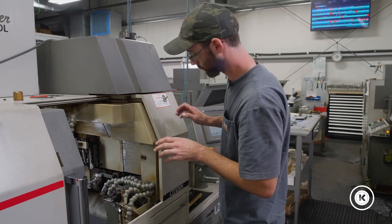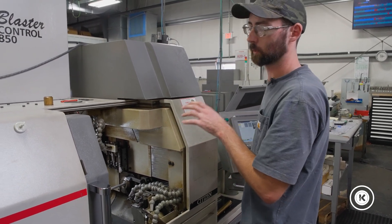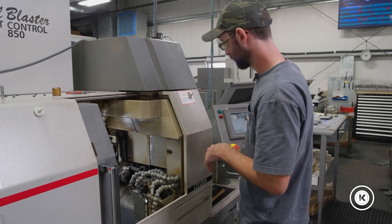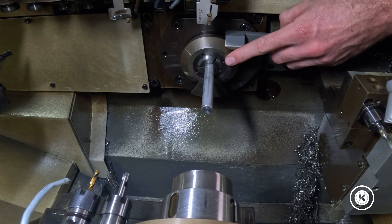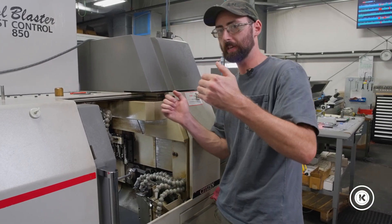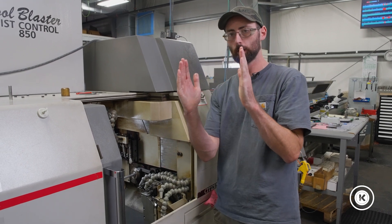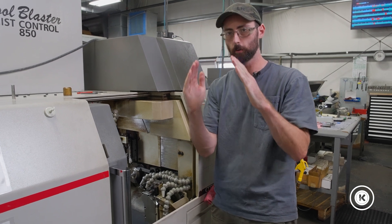One quick and easy dirty thing you can do to see if your guide bushing is going to be good enough to get you started: close your main chuck and just jog your bar back and forth a little bit. I can see I've got some marks where it's contacting the surface. I can pull it back — it's not peeling up material, it's not gouging material out of the OD of the bar. So I know I'm not too tight; my guide bushing pads aren't compressed down into the material gouging material out.